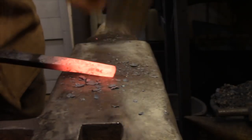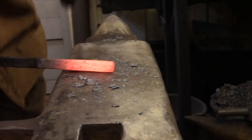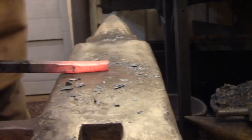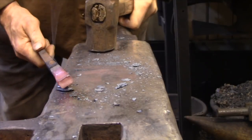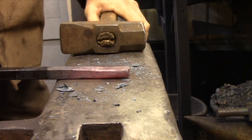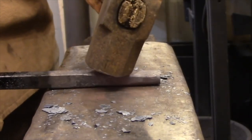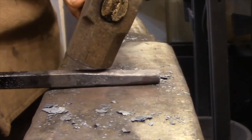For example, here I'm turning a square bar into a round bar — I'm not making it any smaller, just turning the square bar into a round bar by driving the corners back onto itself. If I wanted to flatten this bar and turn it into a rectangular shape with rounded corners, I'd have to step up the amount of hammering significantly. The second technique is called drawing down, which involves making drastic changes to the thickness of the bar. For that you need to move away from the flat face and tip your hammer over slightly until it starts forging with the rounded corners of the hammer face.